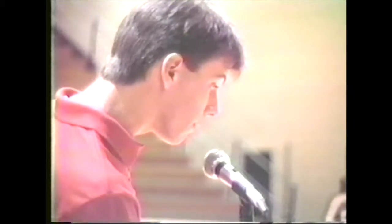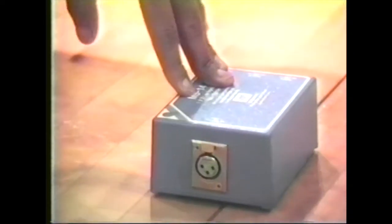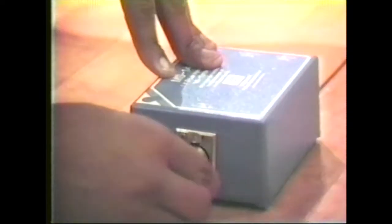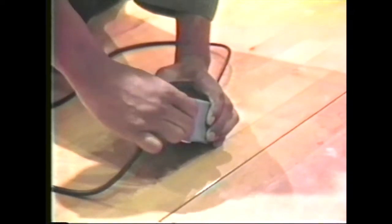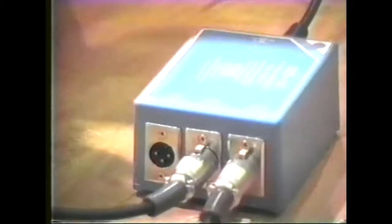The other microphone on the gym floor doubles as the PA system mic. We use a special splitter to divide the signals so that we get good, clean sound from it, and so does the amplifier from the gym speaker. Since our local radio station will broadcast our sound, we have to make it as clear and clean as possible.